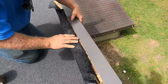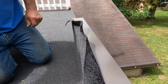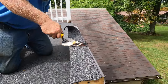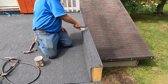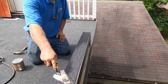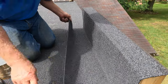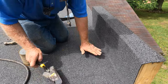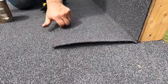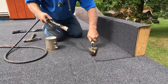Put it down. You can do a primer, but I'm not going to do that right now — I'm just going to heat it up. Beautiful — see that? Now you have a drip edge on the other side. The membrane looks beautiful on this side too. You can heat it or remove the plastic, and with the sun it will start sticking very fast. That is now very well sealed.